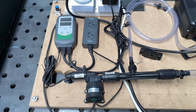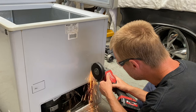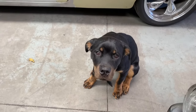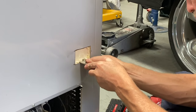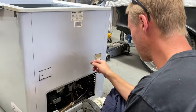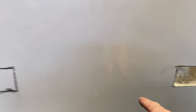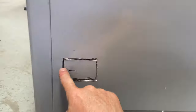All of this had to be mounted on the outside of the bath, so we had to drill a few holes through the side. This has to be done very carefully so as not to puncture the coolant lines. I first removed the outer skin and dug out the insulation to reveal the lines. Now we can mark and drill the holes. You can see in there the lines that run through here — I managed to get a nice size hole right through to the other side. There'll be an in and an out for the water filter.